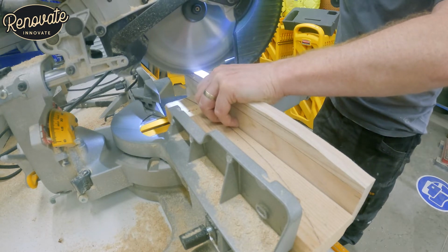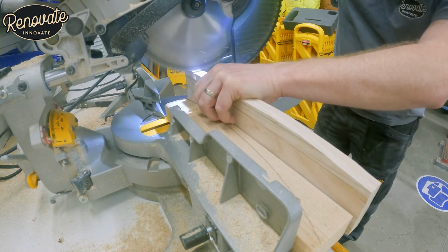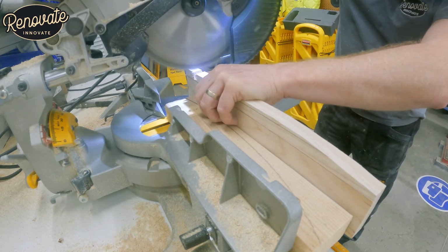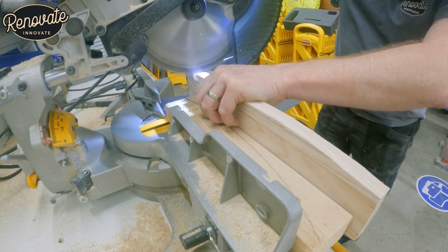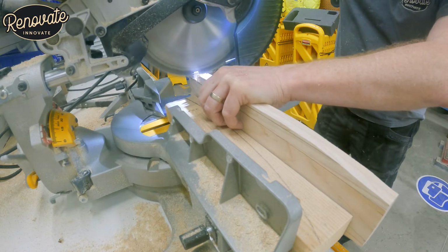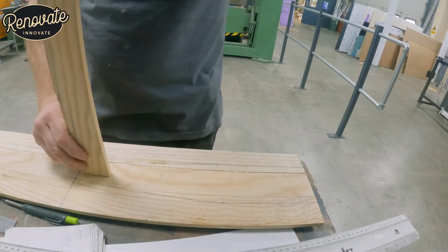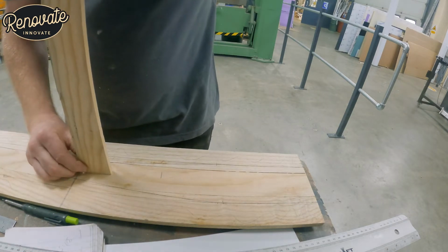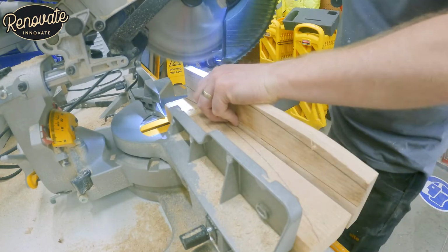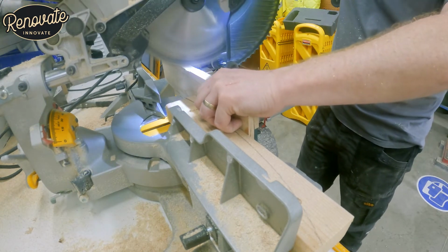Circular saw, use a depth stop on the saw and a little spacer so we could pull the workpiece away from the blade and just cut those nice and simply on there. And then also trying to figure out what kind of a handle we want on it. It would have been nice to use this ash slat as a handle, but in the end we decided we'd go for a broom handle. Easier, and also gave a little bit more room so we could get the beer out.